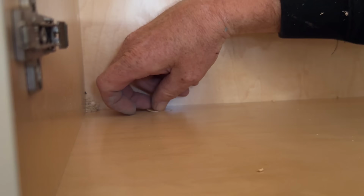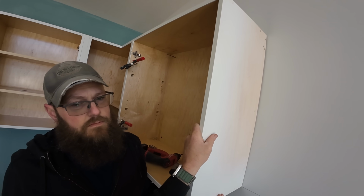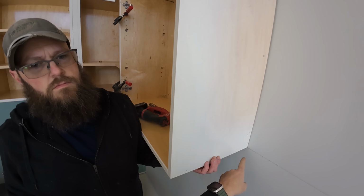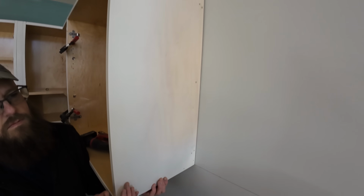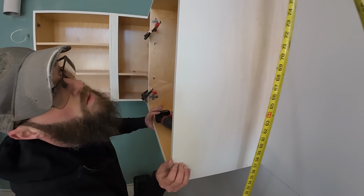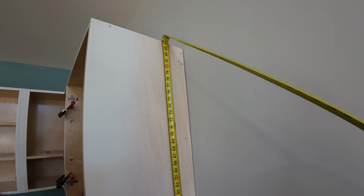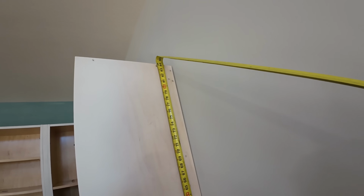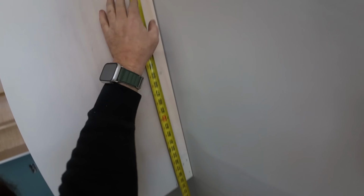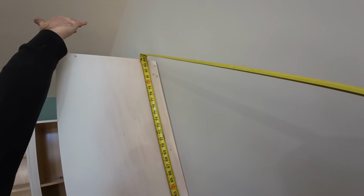Oh, wow. We're installing this wall cabinet, and it's the last one before we hit this oven cabinet that is 84 inches. And even though we've checked that it's centerline, it's level, we're going to also check a hard number to the floor in case the floor is up or down slightly, because it's got to be even. So, yeah, I'm at 84 and a 16th, Nate. So we do need to drop it down just a little if we can.